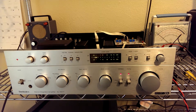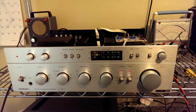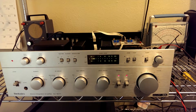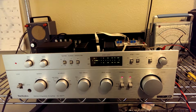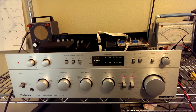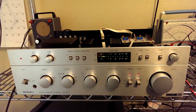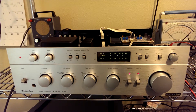And this amp is complete. Bias has been set within about 1 millivolt of its 15-millivolt specification, and DC offset is under 4 millivolts absolute value on both channels. That's a wrap for this unit — I'm quite pleased. Thank you.